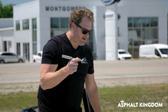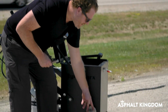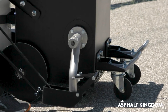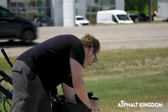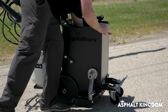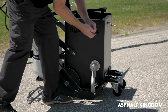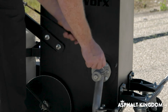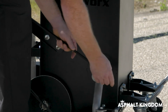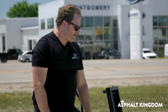I could dremel it in the event that it's a little bit sticky or has any baked-on crack fill on it. And if I wanted to take my entire valve off, I have four bolts right here. I could remove those four bolts, pull the entire mechanism out, and then clean the entire inside of that mechanism. To reinstall, I'm just going to go back into the bottom of my kettle, find the alignment, reinstall my pin, and then reinstall my control rod. In under a minute you can easily remove the pin and pull out and ready to clean your valve.